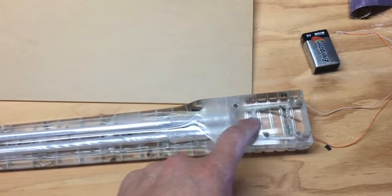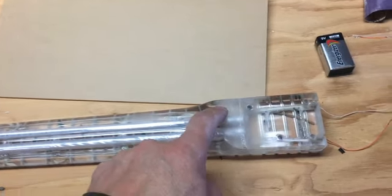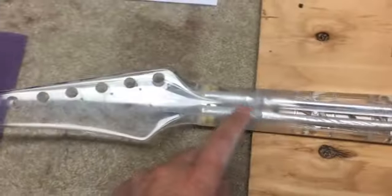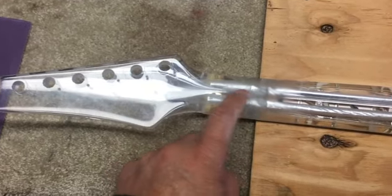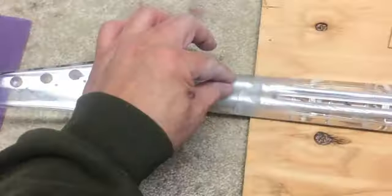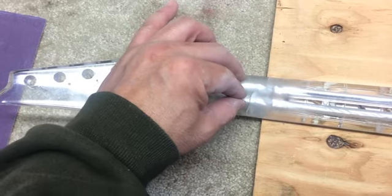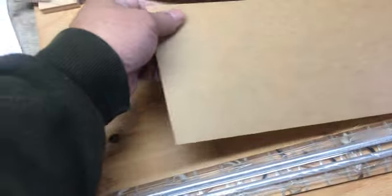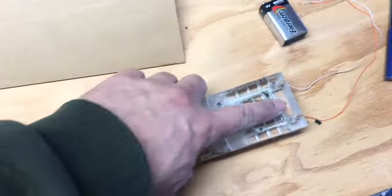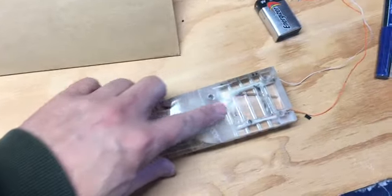But I'll basically be cutting a 1/8 inch slot across this crack. And I'm probably going to do 3 joints here and possibly 3 here. 1 at least. The other 2, I don't know. I mean, it is on the curvature, so it's a little bit tricky to route out. I'm not really sure how I'm going to do it. So the next step, I have to figure out how to cut a clean 1/8 inch joint. Probably have to create some kind of jig or something.